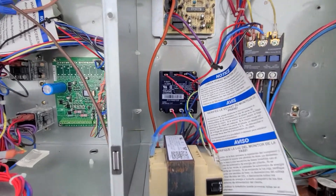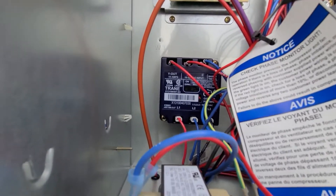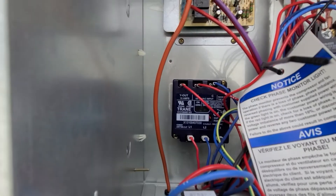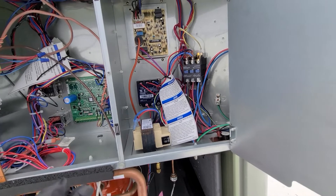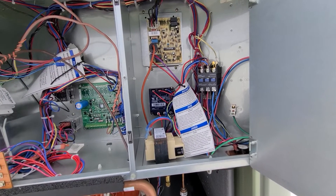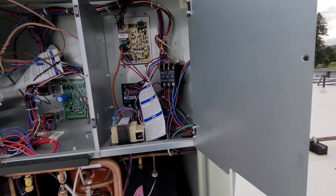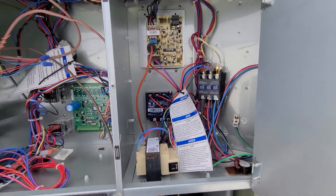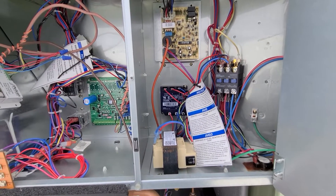Right here is a phase monitor — I really like this product that Trane puts in these units. I have power off to it right now, but when it's energized this little sight glass will be red or green. Red is a phase error — it could mean your phase isn't set right from the get-go when you first fire it up, or you lost a leg, like a bad fuse at a disconnect or breaker panel. When it's green, you're good.